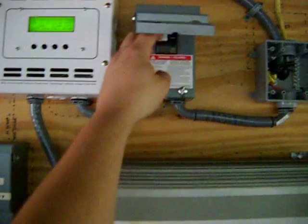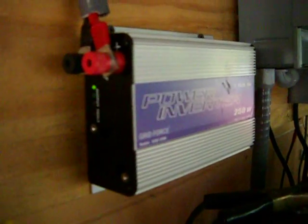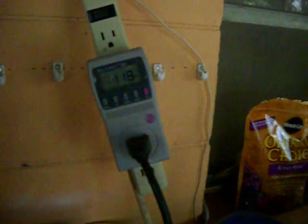We're going to set it to watts because I want you to see the difference in how efficient this grid-tie inverter is in comparison to the charge controller. The charge controller was doing 200 watts — now that's dropped down to about 140 or so, so it should be about 60 watts difference down here, and we're pretty close. So we're going to go ahead and turn off the power going to the charge controller — as you can see, it went to sleep. The green light starts to move faster and faster as the power starts to go through it — it doesn't all just kick on at once. So we should be seeing 200 watts here.